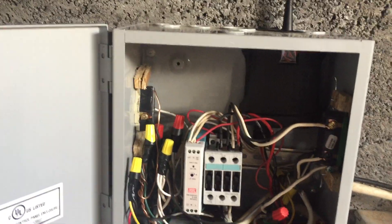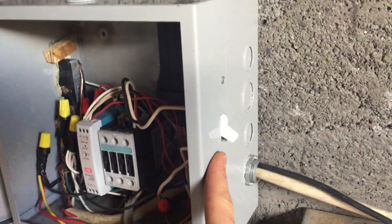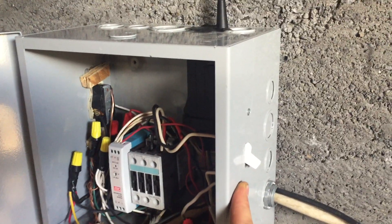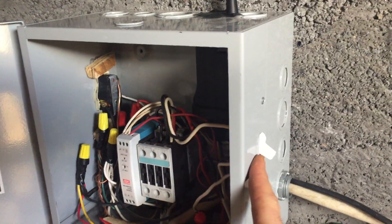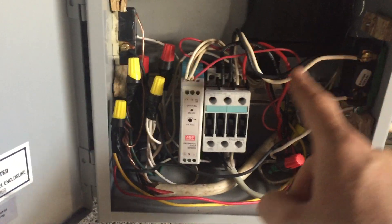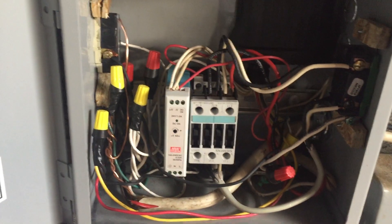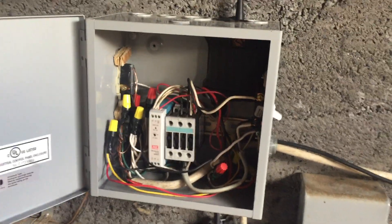The strobe works in the evenings and mornings, but during the day it's not quite visible. As an afterthought, if the system for some reason doesn't work — say the receiver runs out of batteries and they can't get the well started — they can come down here and flip this bypass switch. That just comes in with the main power, jumps from one side of the relay to the switch, and goes back to the other side, manually bridging across the relay to start the pump.